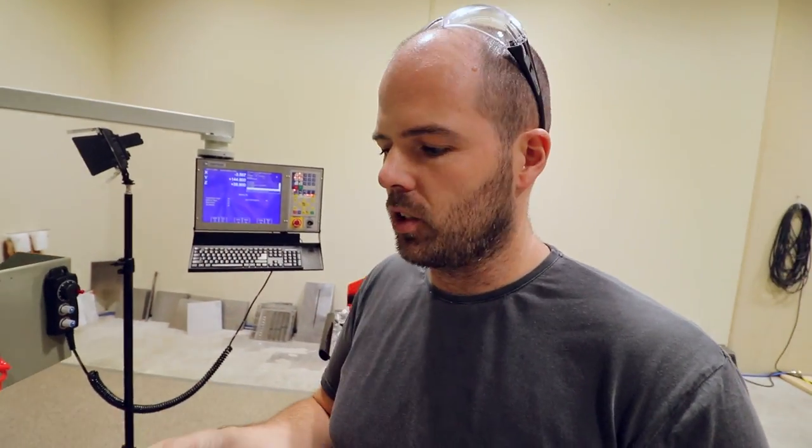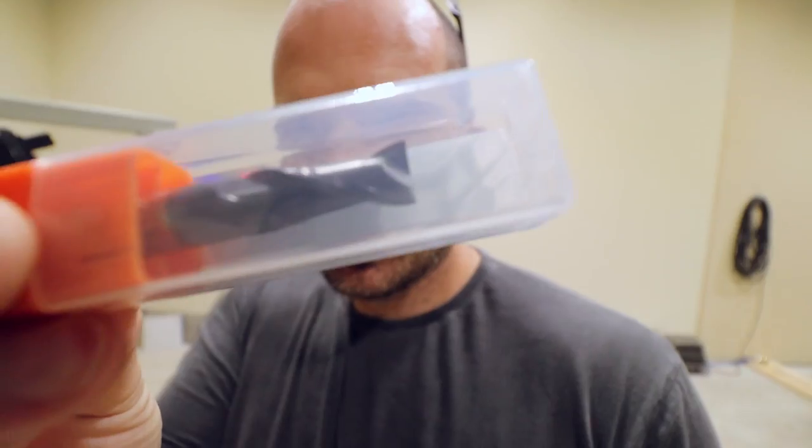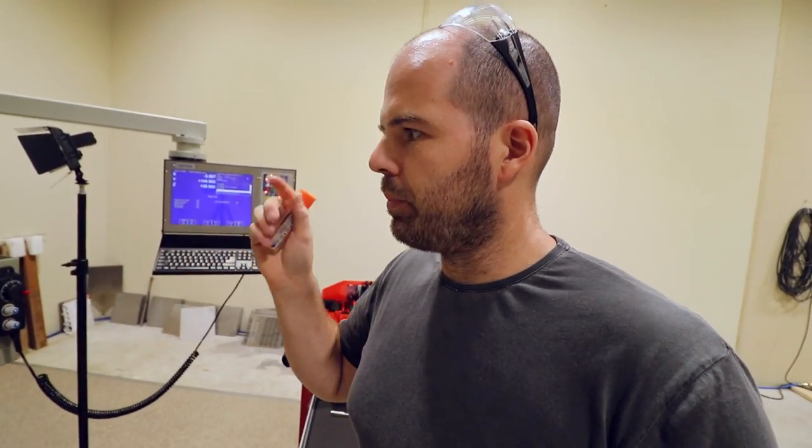It was 12 millimeters. You always want to be using the biggest cutter you can, apparently. So this is 10 mil, but it's only got two flutes rather than the four flutes, so it can only do kind of half the work. So you've got to change the speed and the feed and all that stuff. But I think it might be better off trying this for this job. The high speed steel end mill just doesn't seem to be doing very well. Either that or I've got all my settings wrong.